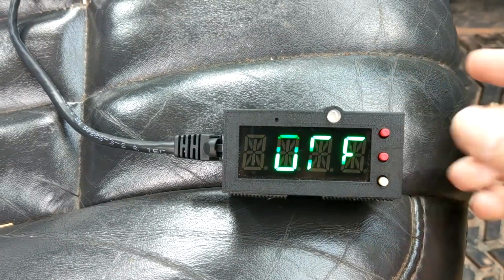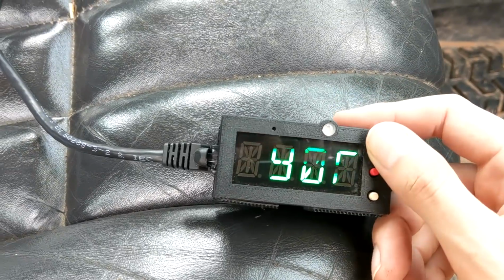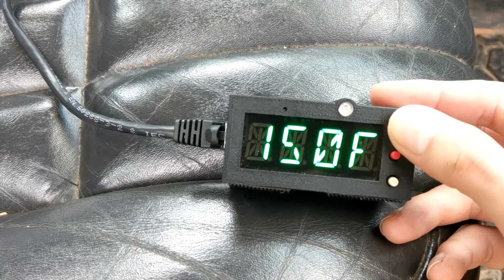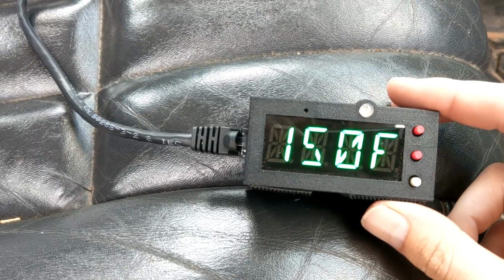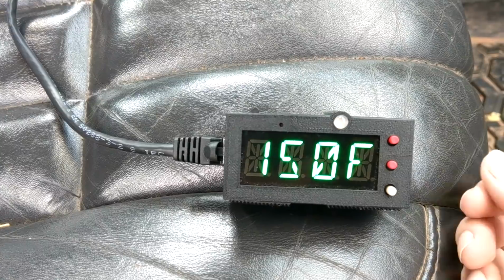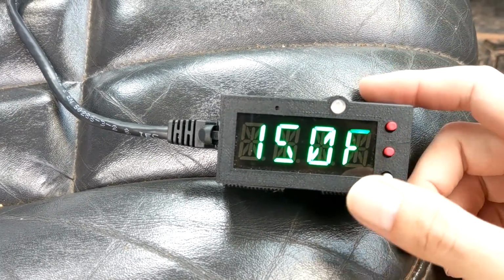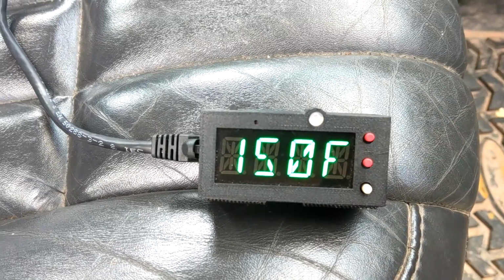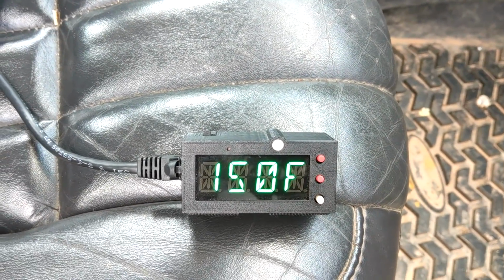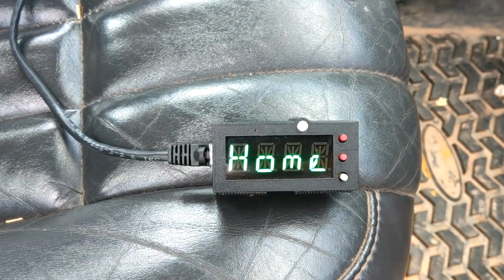On top of that, we also have more smart modes. This is our X temperature. This is the minimum temperature to run the timer. So, say you set it to 150. If the engine isn't at 150, don't run the timer. And when it's cooling, if it cools and gets to 150, it'll shut off early. So that way you've got tons of control on how this thing runs, so you can get it to work exactly how you need.